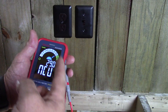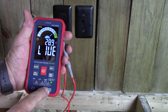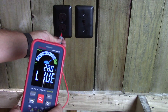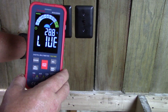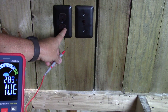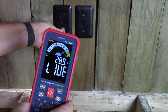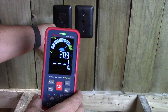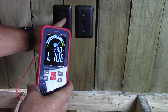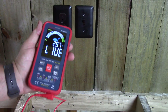It also has a feature where you can connect the probe into it and test to see which one of the terminals on your receptacle is live. Push the select button and it tells you which probe to plug in. Now we can test on our receptacle and see which one is live. This is really handy in case you're testing a house that maybe you didn't wire but want to make sure they wired it correctly. Normally on a receptacle the right short slot is your hot and the left is neutral. So we test this side — doesn't show anything — then this side shows 'L', we have voltage.